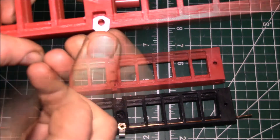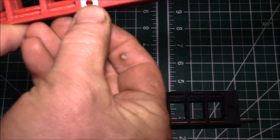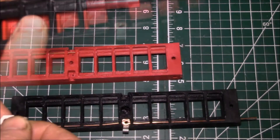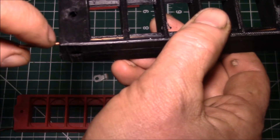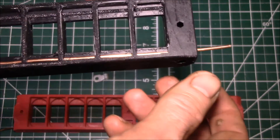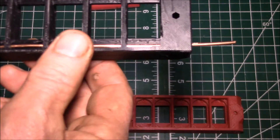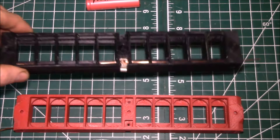Paul Kennett seems to be having good results with those. The only other thing is this terminal doesn't quite fit in there — it's just a tiny bit too wide and too long. I need to flatten the rounded side off against a grinding wheel and knock a little bit off each edge. I also left the wires a little bit long, so I'm going to crimp on some quick disconnect lugs on both ends and use this for the balance cable — so I'll be able to plug in two balance cables, probably one for the BMS and one for a monitoring system or cell monitor.